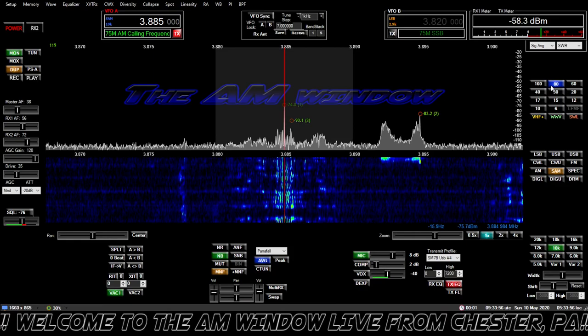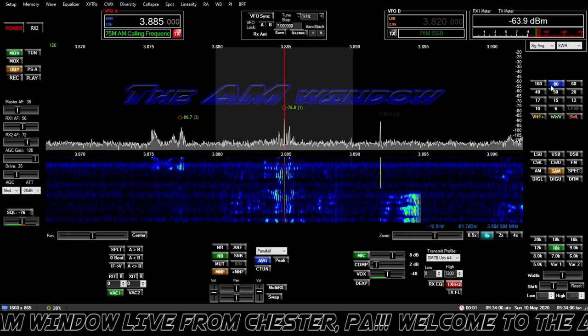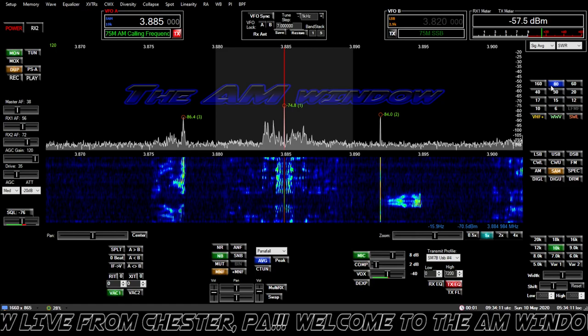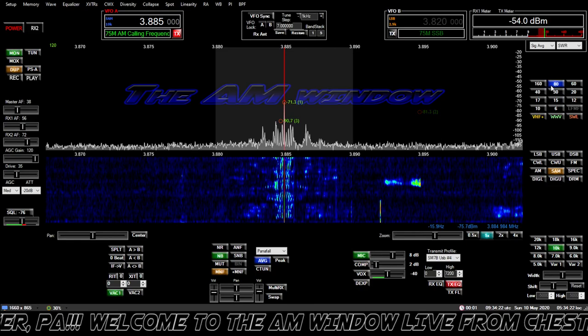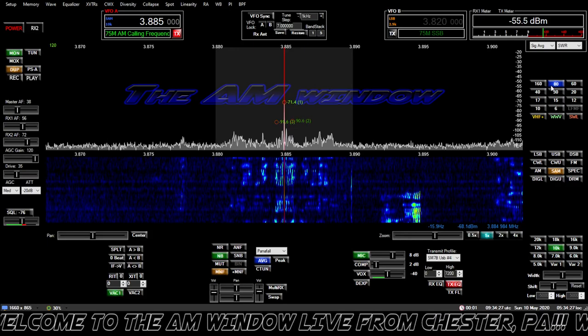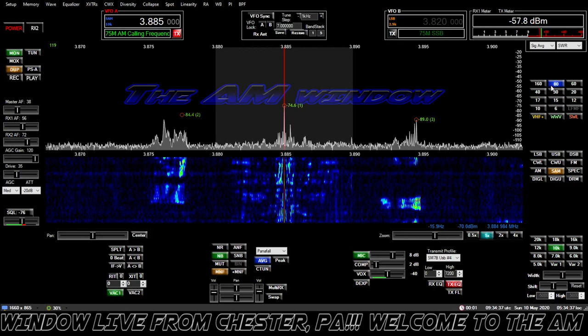Sometimes that happens. But some of the interesting ones are when you point the antenna at someone and their signal goes away, you've got to put the broadside of the antenna to the station you want to talk to, and then you can hear that warbly sound on their signal. That's where you get the best signal strength, and that's usually backscatter. I've worked quite a few backscatter type signals on the 10-meter band. So you get some interesting conditions up there, that's for sure.